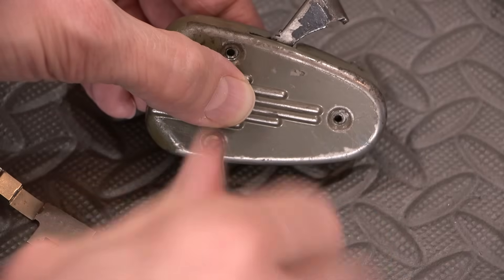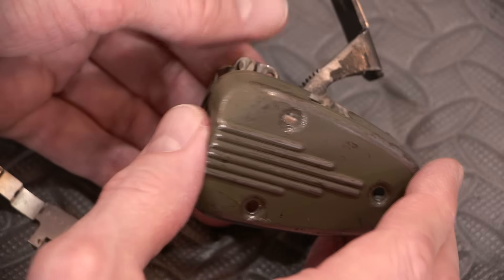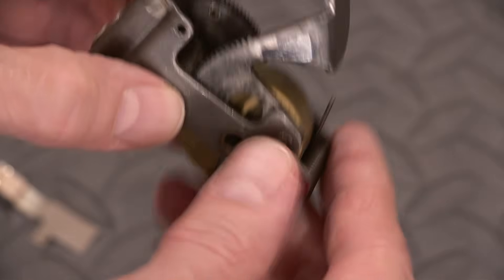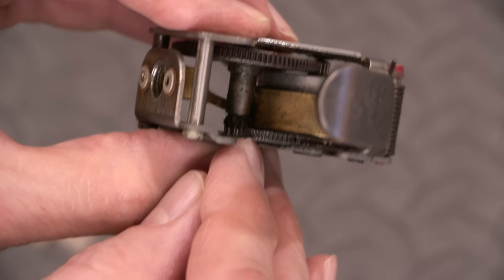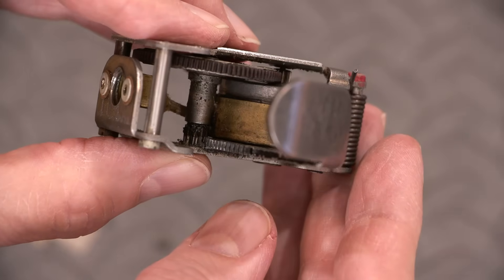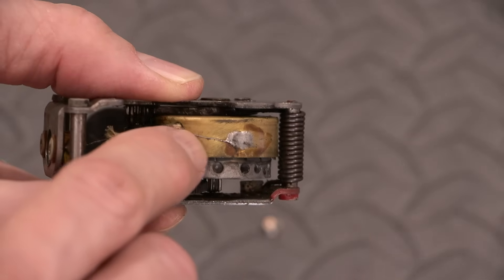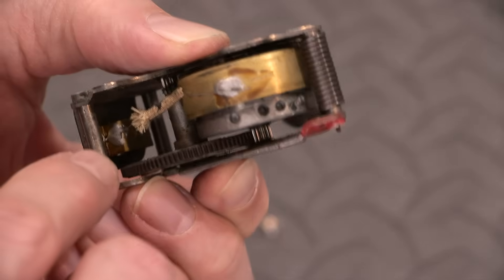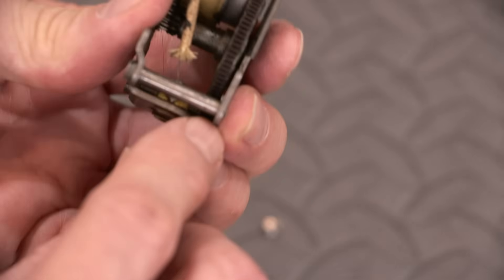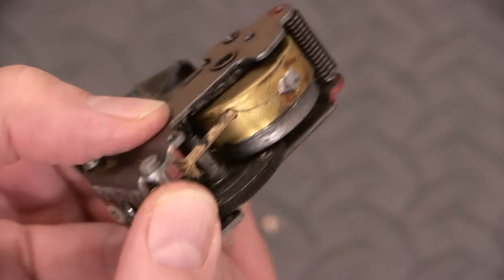The original lens looks to be there but it's pretty loose — almost wanting to fall off. The case just comes completely off. We have metal here and a nice metal gear down there. Lots of old grease and fuzz stuck in there. You can see the little dynamo here — one lead comes out and solders to the case, the other runs right over to the bulb's center connection, and that's insulated from the case with little fibrous washers so it doesn't short.